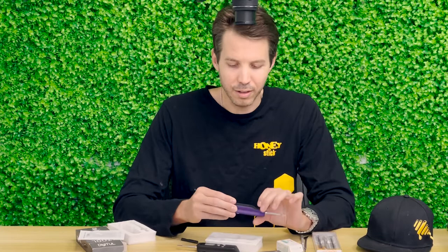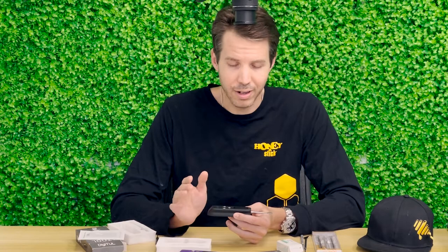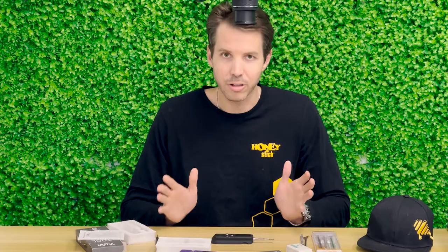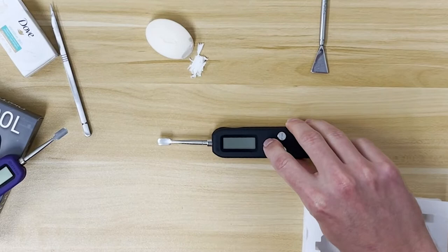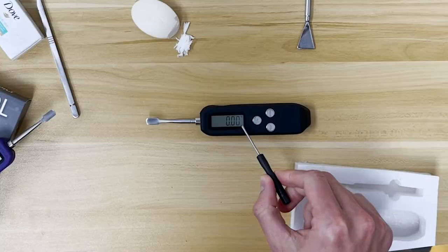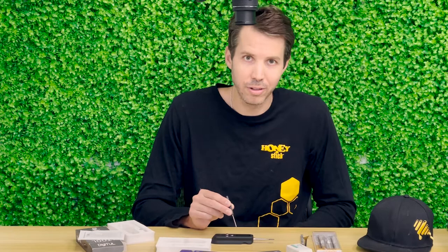So let's talk about the features. It is very highly accurate, going from 0.05 grams all the way to 200. You have three buttons: on/off, hold, and option. Push and hold the on/off button — I like to lay it down flat, because scales work most accurately on a smooth flat surface that isn't moving. After a couple seconds the screen activates, the scale is calibrated, and you'll see a readout of 0.000. You'll also see a 'G' on the display, meaning the scale is set to default and will weigh in grams.